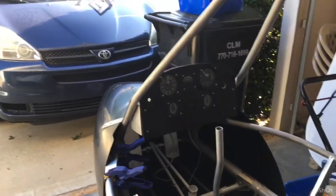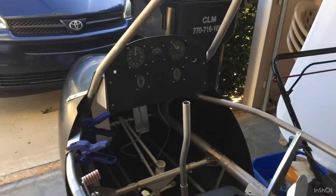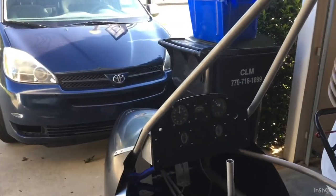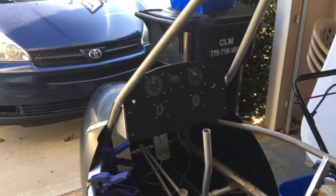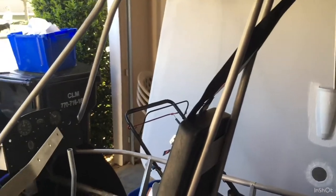The controller's going to be what's installed, and then of course the antenna — you run the GPS antenna to the back. I'm looking at a Trig brand transponder, I think the T22, which is Mode S with ADS-B, because I'm under the Mode C veil — the 30-mile veil of Hartsfield — so I've got to have that. The ELT will mount in the back. The Hobbs meter and ignition are pretty much all I have left on the avionics side.